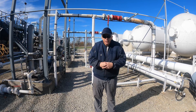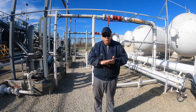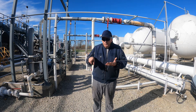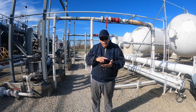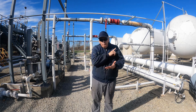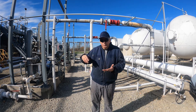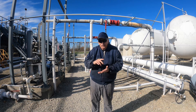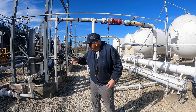In conjunction with that, I wanted to share two things that helped me a lot. The first is to visualize your system as operating in a loop — product in, product out, liquid in, vapor out. If you see your system as a loop, then vapor is going to come from my tanks to the rail cars, liquid is going to go from the rail cars back into the tanks. The compressors are the monkey in the middle, but it's still a loop.